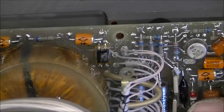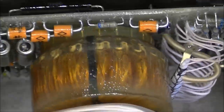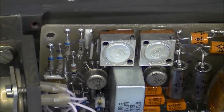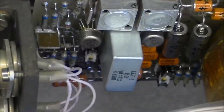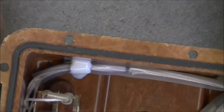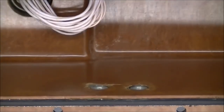Resistor here, the op amp, these weird orange diodes, the big toroidal transformer, and how it is attached to the PCB with legs, more diodes, the trim pots, your fancy capacitors, more op amps, and the big can capacitor, and more gray unknown origin diodes, more vertically mounted and through hole multi-layer ceramics. Same thing on the other side, your two power transistors here of the same kind, and the sealed pass-through to the connector here. And here, your regular Soviet switches. Nothing special here. And a very nice Amberton material.